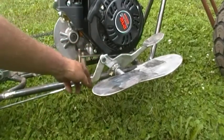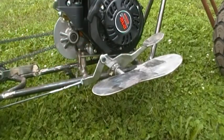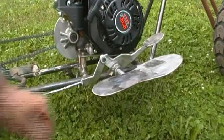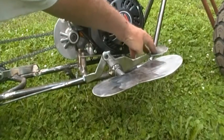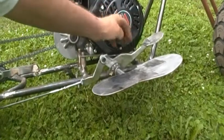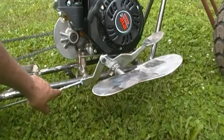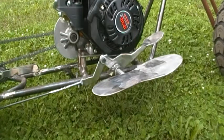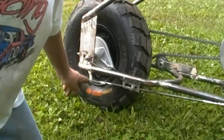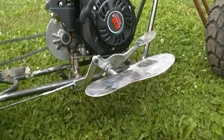I've got a shoulder bolt in here with washers — it's tight on the bolt but the mechanism is loose so it can pivot, and it works. It doesn't look like there's much travel room but right there locks the brakes up, right above the footboard. Right there is free and right there is locked up. I took another long bolt and welded it to the other end of the shaft, cut it to length — there's enough adjustment there, plus adjustments at the other end with the wing nut. There's about two and a half inches of threads there and three inches of threads up here, so there are plenty of ways to adjust it.